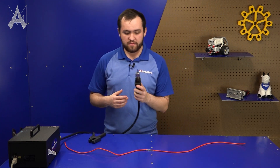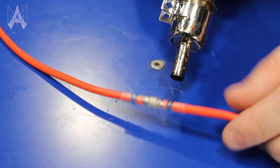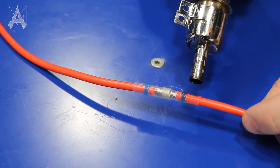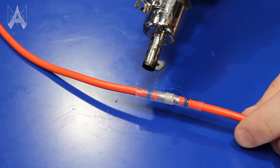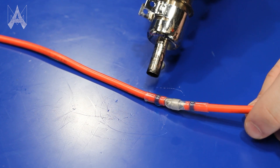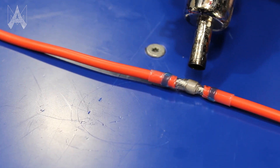Any hot air gun would work, but I'd recommend using one with a fine tip — like a hot air pencil — so you can get very precise. Lower your temperature a little when starting, around 300, just to melt the shrink tubing and the glue, then raise it when you're actually doing the solder. Start with one end, melt the shrink tubing and the glue so the solder will not escape when melting. The glue will turn to liquid and make it both waterproof and structural, holding in the solder. Once both sides are sealed, melt the solder directly — hold it on there until it turns to liquid, then slowly turn it so it all gets melted.